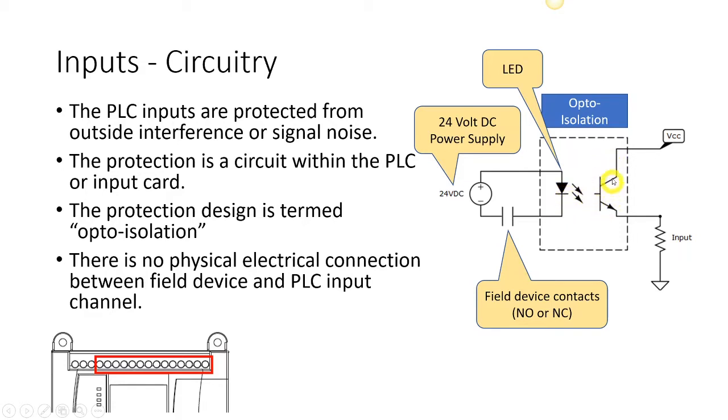And this right here is a photosensitive transistor. And a transistor, in its simplest description, is just a switch. When something happens here on this little stem, this is going to let current flow through here. If we don't have some sort of activating event here on that little stem, and a lot of times that's actually voltage coming in, in this case, it's a photosensitive transistor, so if light is coming in at that little stem, this is going to be for all intents and purposes, a closed switch. So when the light comes on, that switch is closed. When the light goes off, the switch is open. You can think about it that simply. We really didn't study transistors in first semester, but for all practical purposes, that's how it works.